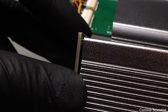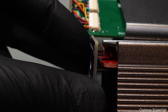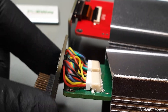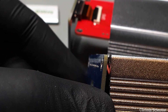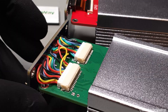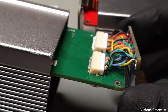This is what we expect. And actually the previous connectors are also quite good when it comes to fitting. The problem is the cables, they take up a lot of space. Then they have to be crimped with the proper JST terminal and they have to be soldered as well. So I just want to emphasize again that it is very tedious work to use these connectors with the JST terminals. So now you can see why I took the effort to slightly redesign the PCBs. With this new front panel and the main panel we have a much more clear layout, and this also makes the whole assembly experience much better.